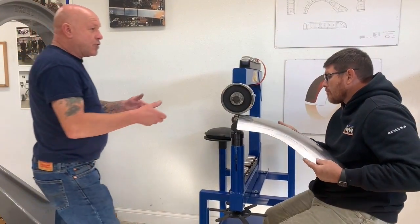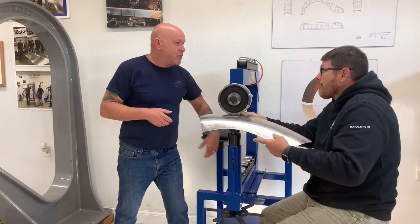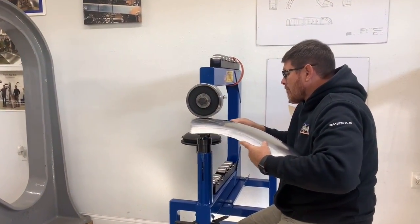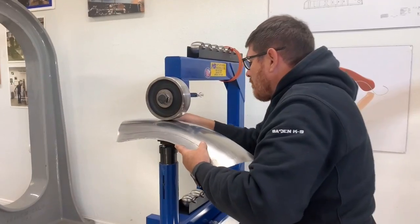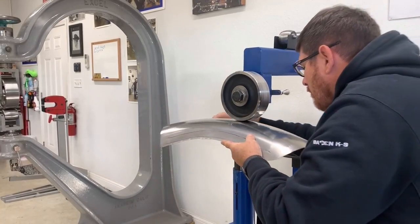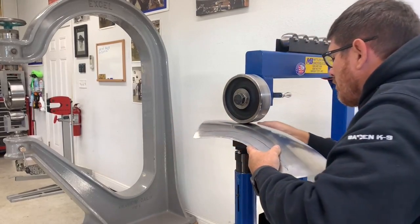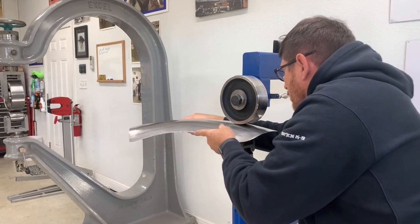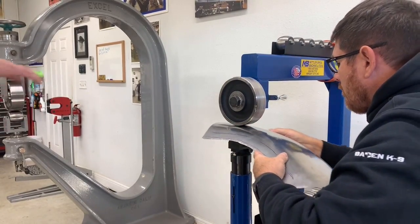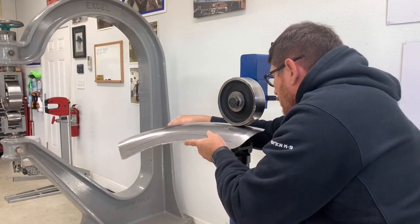So that's why I like to work on the outside of the wheel, because it's more consistent. Working on the inside of the wheel, my shoulder's so close to the thing, sometimes I can't reach in that far. So I naturally just use the outside of the wheel. That's my preference, that's all. So I've got the pressure just enough for you to be putting shape in, but not too quickly. And once you get the technique down and keep all your blow marks nice and close together, we'll up the pressure, all right? Mm-hmm.